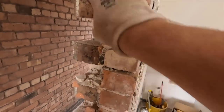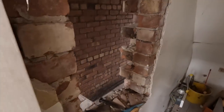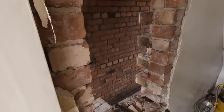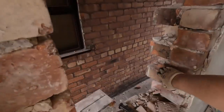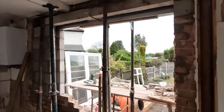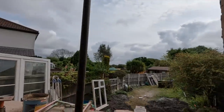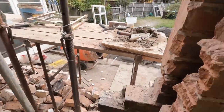This is ready for bricks and blocks now. As you can see, it's a 9-inch wall, so no cavity needed. And I think if we measured right, this just works. A nice block, so that'll work out nicely, just sliding a block in. Obviously this side, it's got a bit of an English garden wall bond. Dad has very cleverly propped up the lintel with some scaffold that the customers have over there. And yeah, Dad's finished.